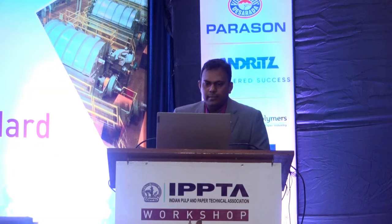What does open cooling system mean? We have this in the paper industry. We need cooling water, filling water, DM water, process water. But some mills are not differentiating this, what is the meaning of cooling water, where we should use the cooling water, where we use the mill water, where we use the DM water. Always they are using the same mill water for all the applications. If you use the mill water for all the applications, then you will end up with excess usage of water and excess generation of the bleach condensate.